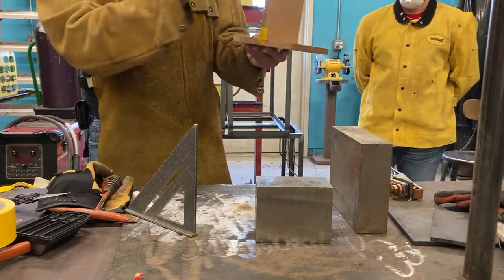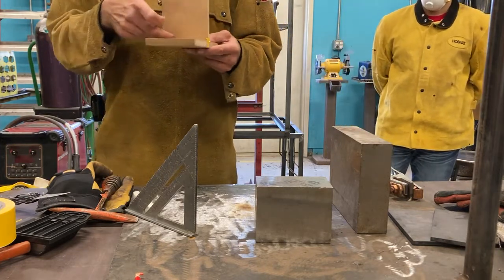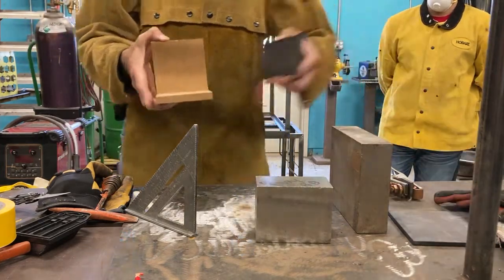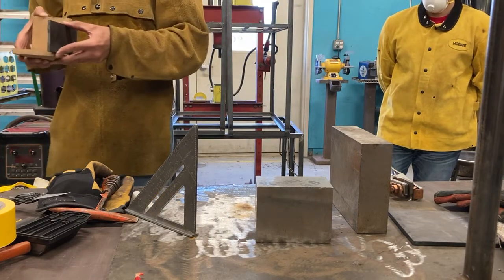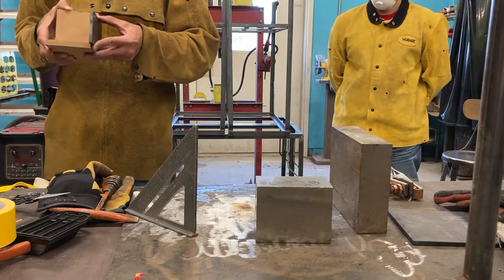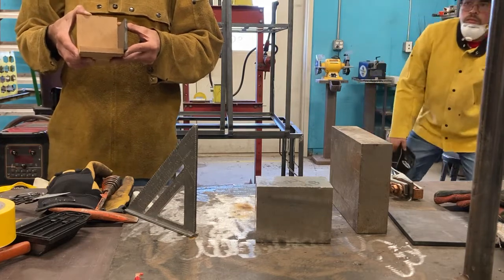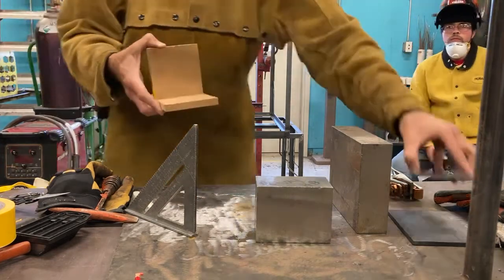Very, very easy. If you have a tack in here, suddenly it could get very, very difficult. You may not be able to get a grinder in there. If it's a situation like this, where I've got another piece in place, there is no way you're getting a cutting tool in there. And this is actually the situation that will be set up in the suspended T. If you goof up tacking that thing, there's no recovery. It's a one-way welding process. So we want to think ahead.